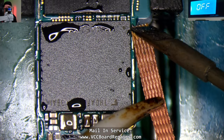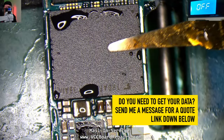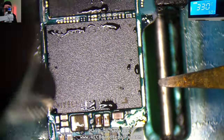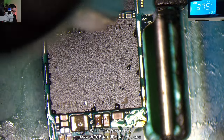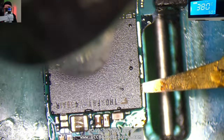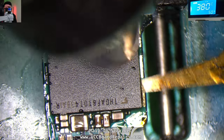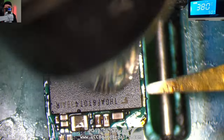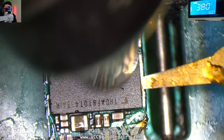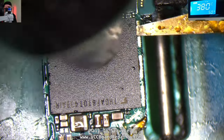What I'd like to do is first wick this flat and then shave down a spatula tool. These are the customer's chips — the ones we have to save. We are going to check the health of this UFS chip. This is the memory, the storage — like the hard drive of the phone. This is where all the data gets written into, but it's encrypted. The data is jumbled, and the only way to unjumble it — to make the data readable — is through encryption keys that are in the CPU. So they're paired together for security purposes, which makes it difficult for data recovery.